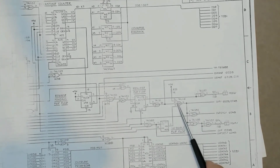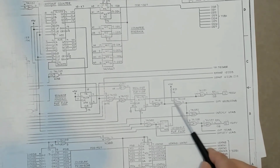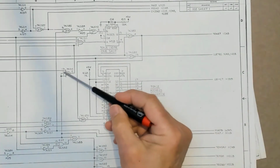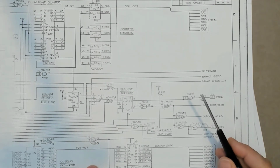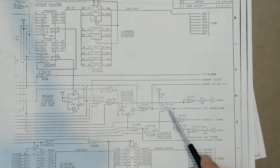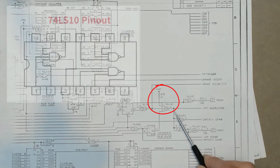Well, when I was looking at the NAND gate on the other two pages, I saw the extra one. I just presumed that they had an unused input that they didn't need like they did on this AND gate here, the 74LS11. So on those, that's where I first saw it, and that was just my presumption. I wasn't even looking on this page yet. But now it's obvious because this is the third gate inside A88, and A88 only has 3 gates.